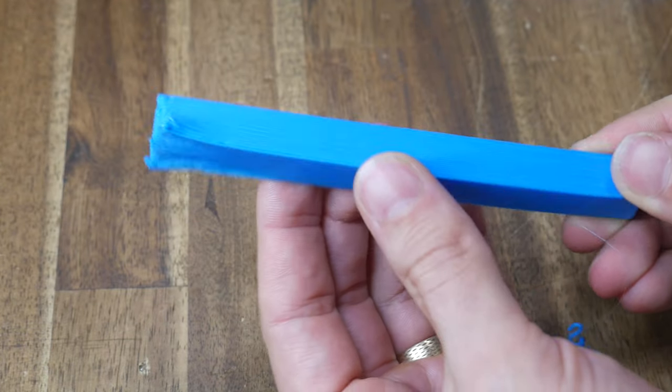My main issue? It's just not as sticky as a traditional bed. Early on, I decided I wanted to print an enormous folding propeller assembly. I imported the blade into Tinkercad, cut the base off to make it flat, and added a little brim. On the belt printer, everything started well but adhesion was lost part way along the blade — the part wobbled around, looked terrible, and eventually fell off. I came back and added a brim the whole way down the narrow section, but even that one fell off and I had to abandon the project. So I employed one of my old favourites — a liberal dose of hairspray — and I'm pleased to report that things improved. Adhesion was strong enough to support this sword merely by the end of the handle, the rest hanging in mid-air. Rotate the belt to run the object off the edge, however, and it still comes loose without any issues.